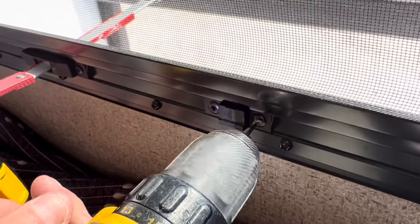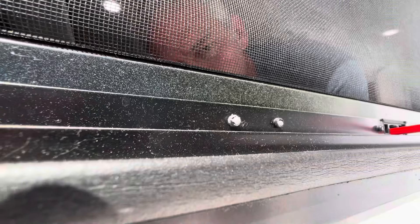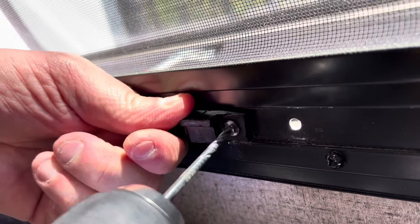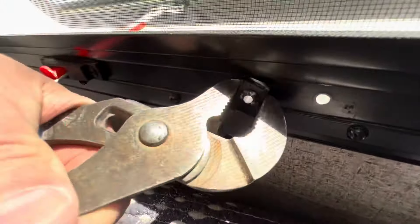Troy started with a smaller drill bit to get a hole started in the rivets and then worked up a few sizes. We didn't want to make the hole any bigger than we needed to to get the rivet out. "Okay, I've got to step up in size now." "I'm trying to snatch it out." "Alright, it's loose on my side — I'll have it out in one second." The first rivet came out pretty easy, but the second one we ended up using pliers to gently pull it out rather than using a bigger drill bit and potentially making the existing hole in the aluminum frame even bigger.